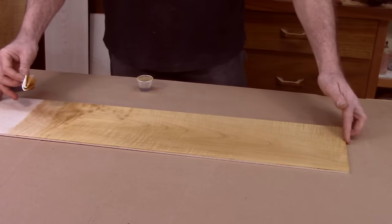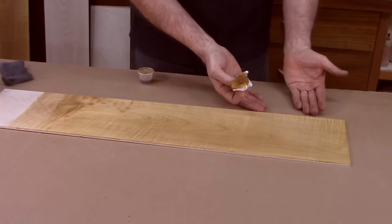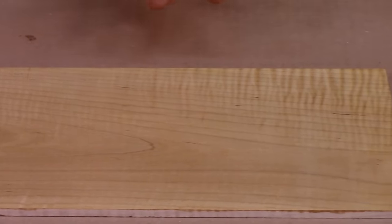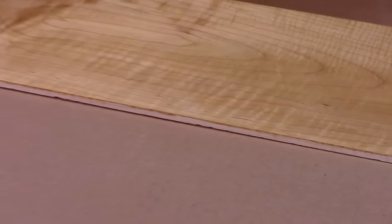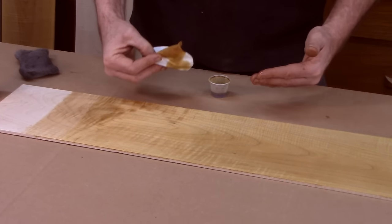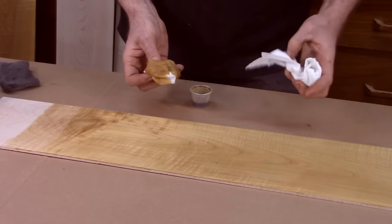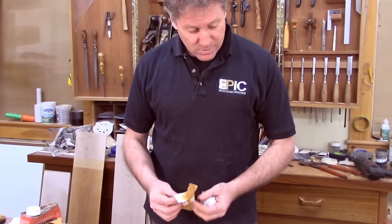And that's it — so that's three coats, and it's really starting to look rich. The finish is absorbing in and the curly figure is starting to pop. It's a very light amber color — you can see the amber in the finish on this paper towel. It yellows out the finish a little bit, but the maple is naturally a little yellow and it gets a little more yellow and deeper in color over time. It's certainly a foolproof way to get really good results on curly maple.